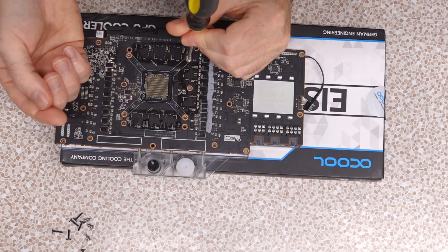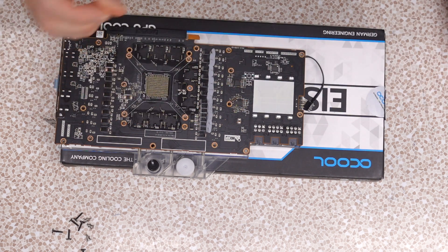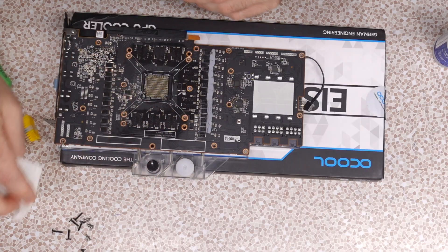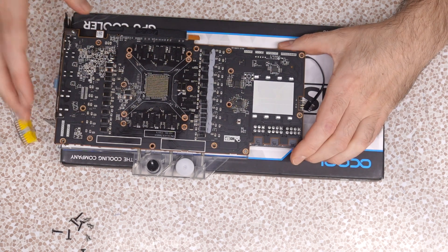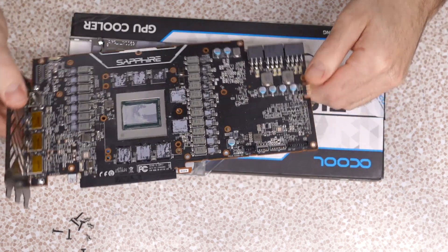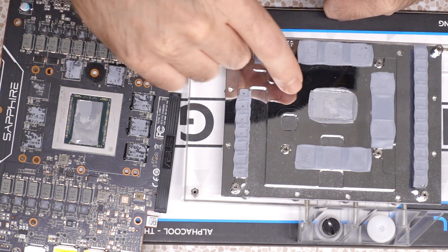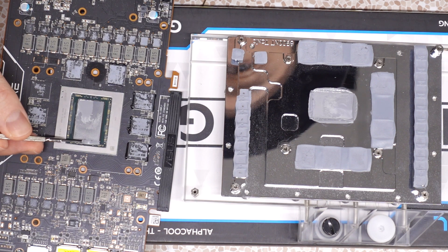There are those little plastic washers that I misplaced two of last time I worked on this card. And what is this moisture? There are SMDs and this moisture — I guess it's non-conductive. It's not water; this is the top of the card. Unless that's condensation? It feels kind of oily — like some sort of oil came out of the thermal pads. Okay, this should pop right off now. There it goes — yeah, look at that. That's what's left of the PTM 7950. It totally schmooed out the side like thermal paste — this stuff turned to thermal paste. It melted out and then solidified again.